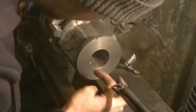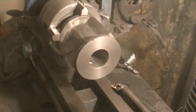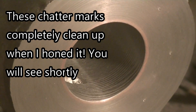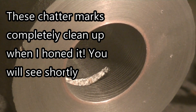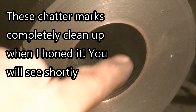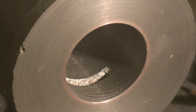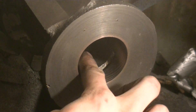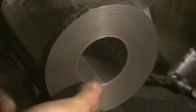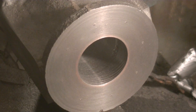The chatter is bad in the front, but it really doesn't matter — it just looks so bad. You can see those chatter marks, but the place where the actual piston goes is fine. This section doesn't need a piston seal like the actual main bore of the engine does. I'm going to take a measurement past the steam port and see what kind of reading we ended up at. Otherwise, the finish inside looks really nice — it's just that one chatter spot.